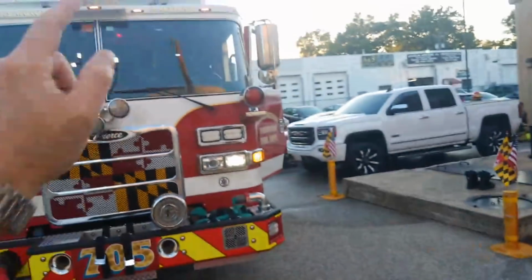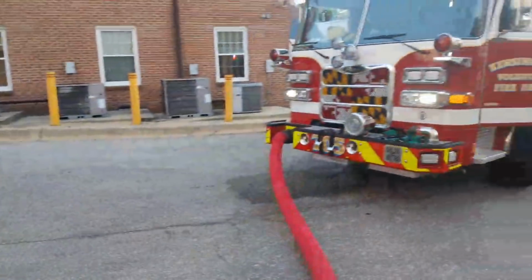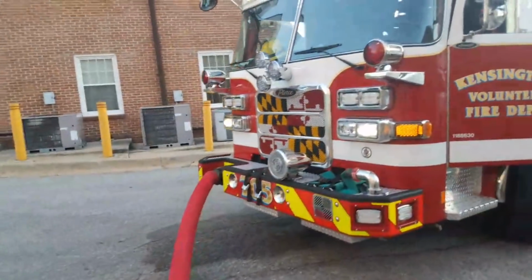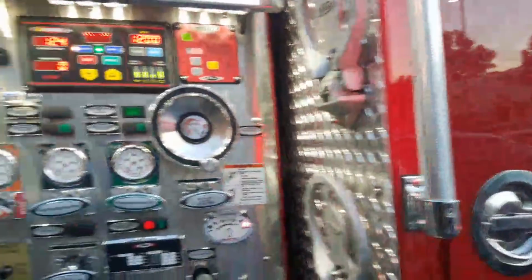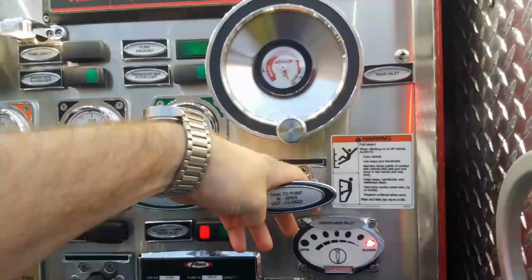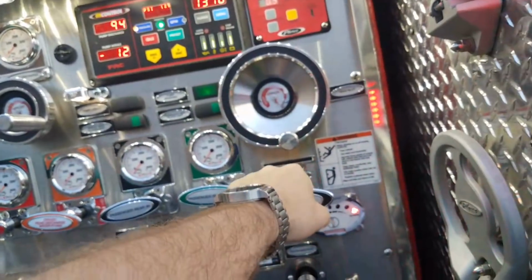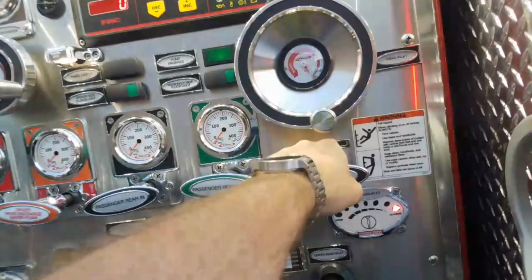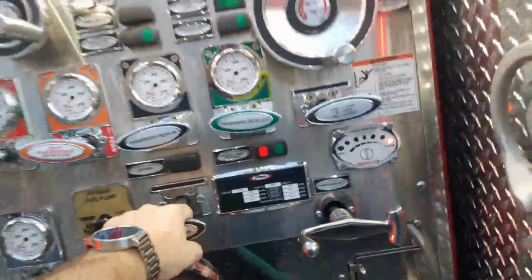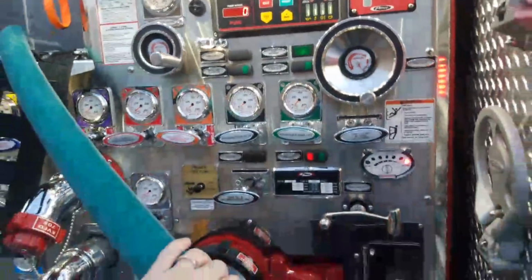And keep in mind, you have a tank of 750 gallons of water already with you, so you don't need a supply coming in from your tank yet. Actually, right now, we might not be filling our tank. I don't know why, because we're not. Oh. So we are completely right now just going tank to pump. That's why. We need to open this thing up so it's actually on. I started to cause a cavitation because I closed that thing off. Why isn't this thing filling up?